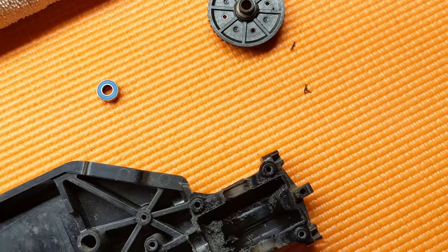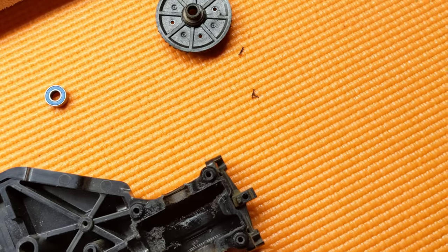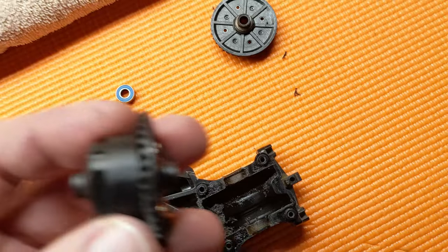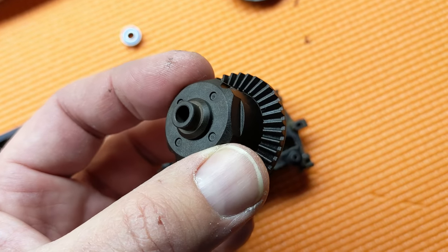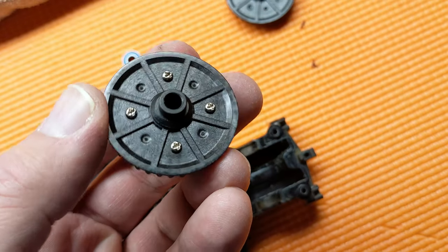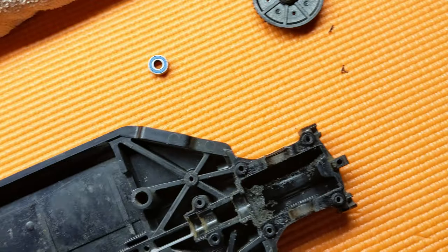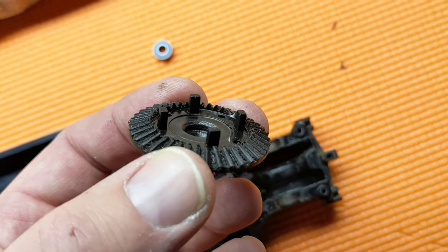So goodbye to that, and we are going to use some new plastic gears and some bearings, which should give this much longer life. I'm going to put in brand new ring gears. I've been rebuilding this for a little bit — I took it all apart and I'm replacing the parts that need to be replaced. As you can see, it wore down this gear because of all the play and movement — the gears were slipping.